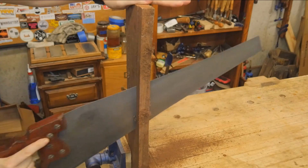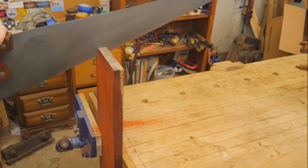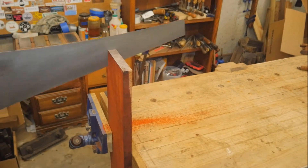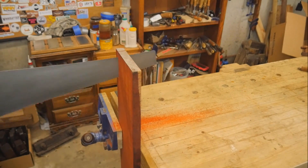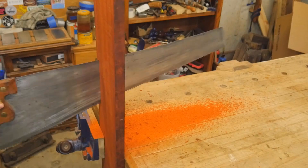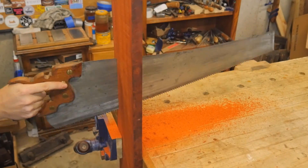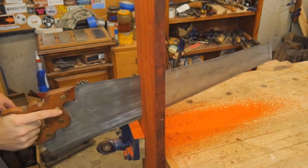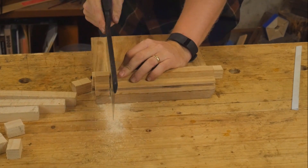The hand saw with the walnut at only about an inch wide works very well. The padauk, on the other hand, is a whole other story. If you've never cut padauk, it is very hard and will dull a saw quickly — it is very much like cutting Purple Heart. But the sawdust is gorgeous: bright, bright red, and a lot of fun to play with. I ended up cutting all of this down into strips about 3¼ inches by 3¼ inches, about 30 inches long.